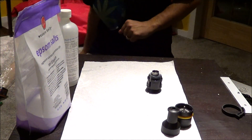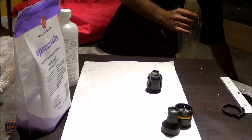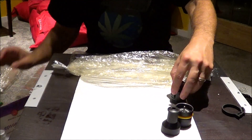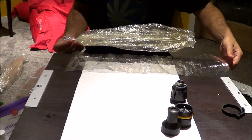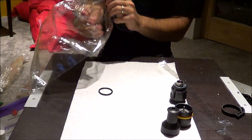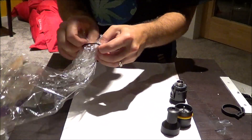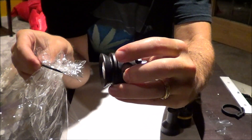The bag is kind of nifty — it comes in a box and they come in 20-foot rolls. Your goal is to make sure the bag you cut out of the roll is just slightly longer than the bag you're replacing, because you're going to lose a little bit of length in the transition. Then you take the black rubber and feed it over top of your bag.